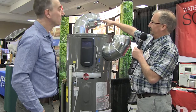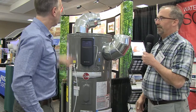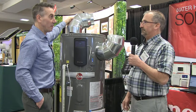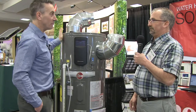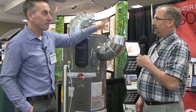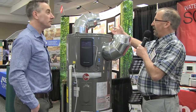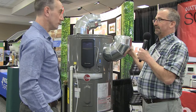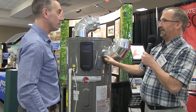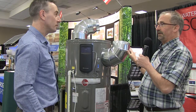This is the intake at the top and this is the exhaust. You could put the intake into a warm, moist bathroom to pull the heat and dehumidify that space, then put the fresh air back into a completely different room like a bedroom. You'd want to pull the air out of the bathroom to capture all the latent heat and put it back into the tank, then exhaust into another living space or into the basement.